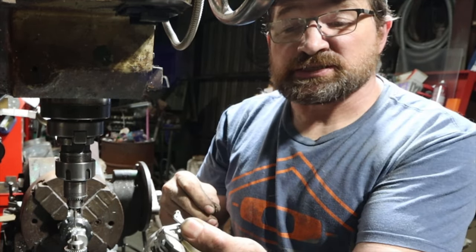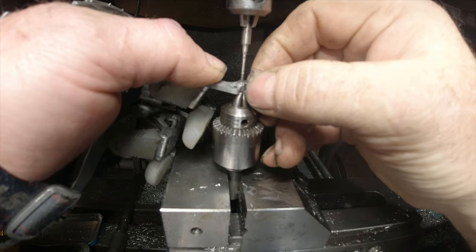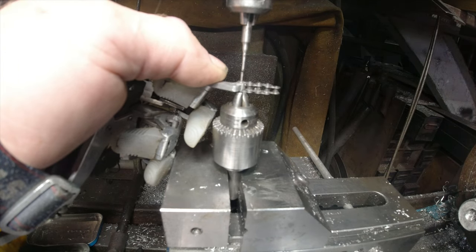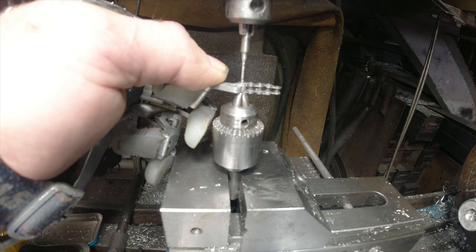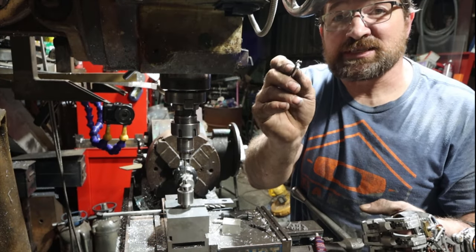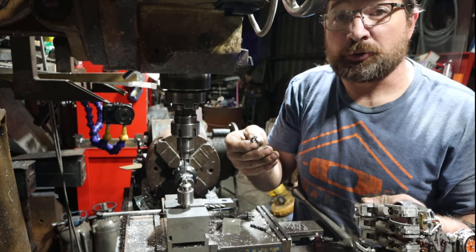In this case, this is the center link to the lock link assembly. Once you have everything assembled, put it on top of the bottom chuck, line everything up, and gently reassemble. For best results, you want to have the same length of rivet exposed on either side — that'll make sure it won't separate under load.